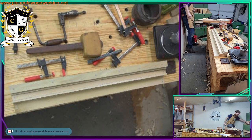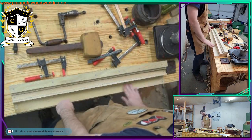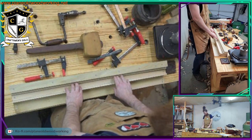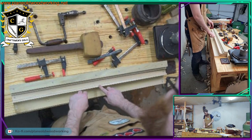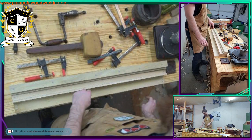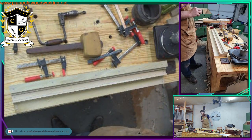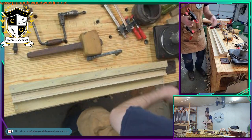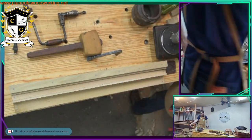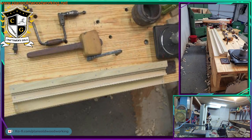We have actually made the more advanced sticking board for myself. So I can just plow the rabbets here, and then I have rabbet support for whatever else I'm doing. This is all for just basic 1x2 pieces of poplar. So we're doing good. I'll probably have to build a new one if I want to make bigger profiles. But we have a sticking board that can be used for basic frames, basic small picture frames. And that was the goal.